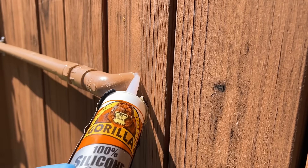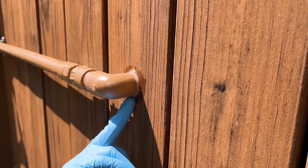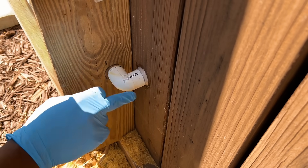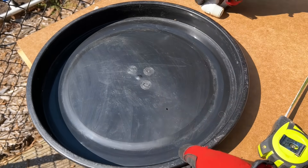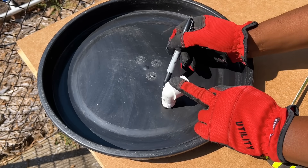To help prevent water from rain from building up inside the inflow and outflow holes I drilled, I added silicone around the exterior PVC connections. Next I worked on adding a vent to the lid of each rain barrel so that air trapped in the barrel can have an escape point as the water rises and falls.